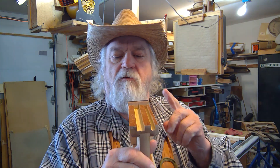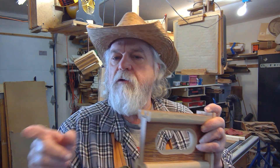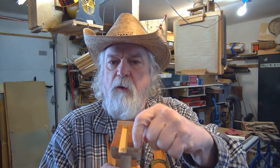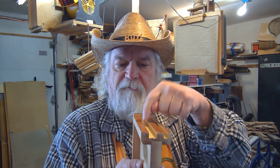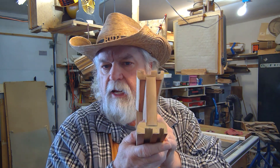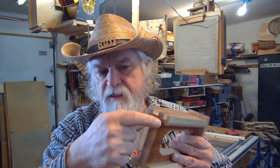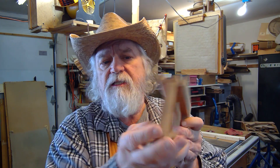I'll show you how to make this one — no magic involved. You take a piece of wood; I'd use hardwood, I made mine out of MDF. The piece is three-quarters of an inch by two inches and six inches long, so I'd start with a 12-inch piece. You cut two dados into one surface: come in a quarter inch from the edge and cut a quarter-inch dado, then move over a half inch and cut a half-inch dado. That gives you a quarter-inch leg, a half-inch leg, and a half-inch leg. Then I put a dado on the back side of the 12-inch piece so I can put the centerpiece into those dados and glue it up.